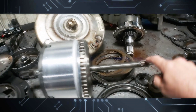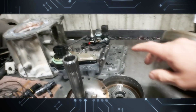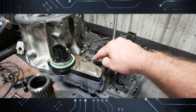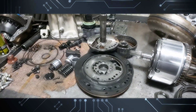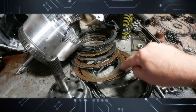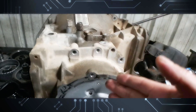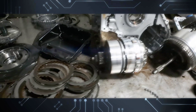This video was for this unit and not for this unit, but as you can see we have the same drum. The input shaft is different because the 42RLE torque converter has a long hub, as you can see there. This is a VLP-type valve body, VLP-type unit, which has variable line pressure control — you have the pressure control solenoid and the pressure transducers there, so they say '07 and up.